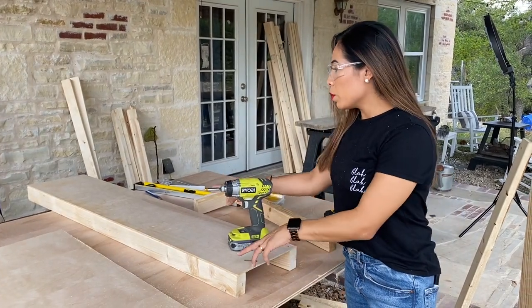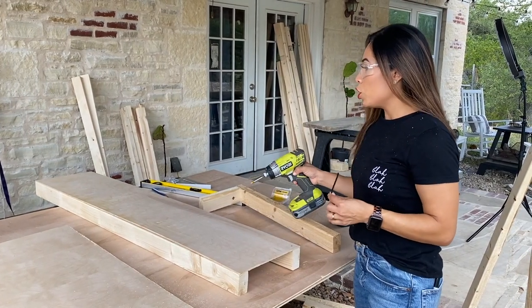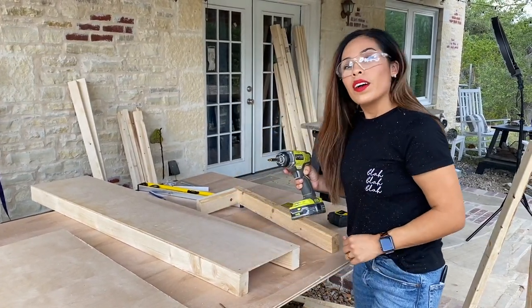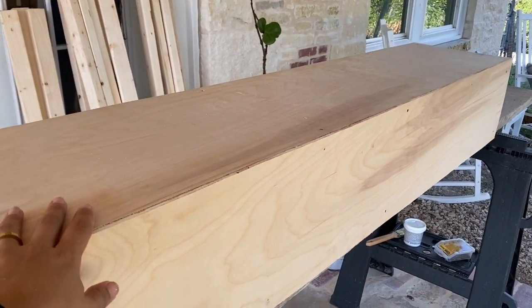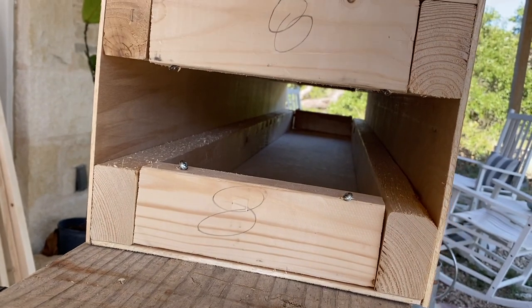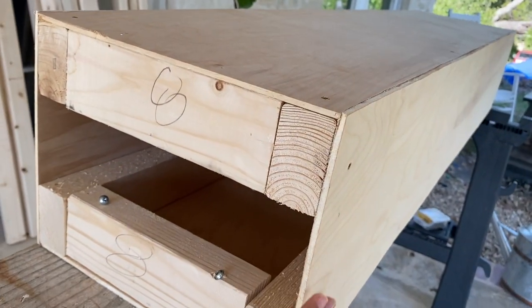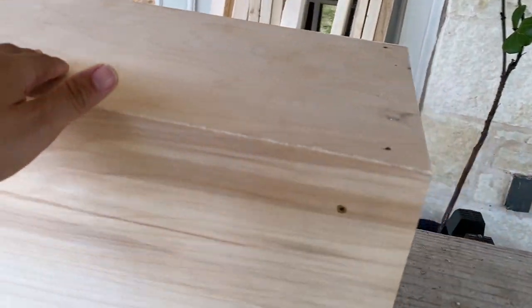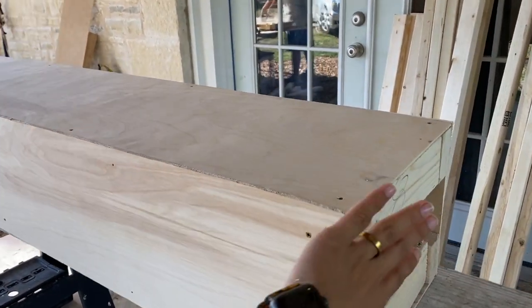This is what the cut board looks like. We've already placed our two-by-threes on the bottom, and I'm going to take these screws and begin screwing through the plywood onto the board. After some calculations and problem-solving, this is one of the four-and-a-half-foot columns. We did have to add some small boards after putting all the plywood around it, so that when we apply the base it'll have something sturdy to hold on to. Now we'll cut the plywood pieces for the bases and we'll have our first finished column.